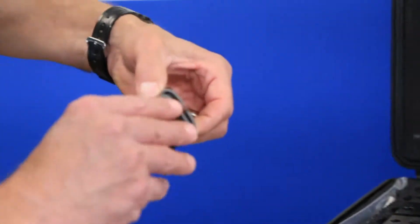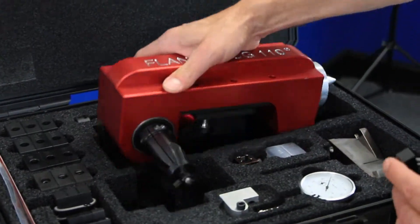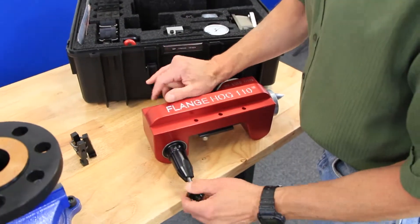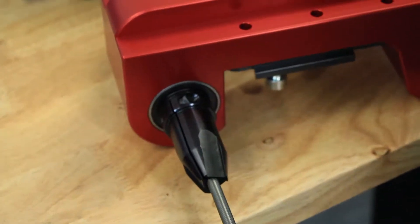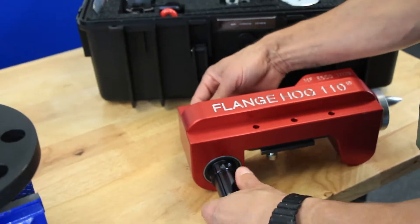In this case, we are facing a 2-inch flange and will need the H3 ribs, small wedge, and associated draw rod and actuator. Start by attaching the clamp ribs to the actuator with the taper side facing in and inserting the draw rod and actuator assembly into the tool.